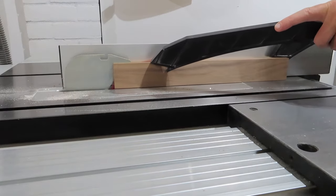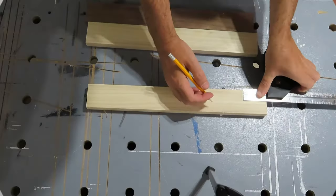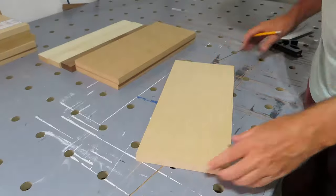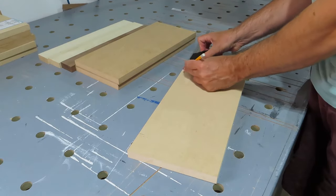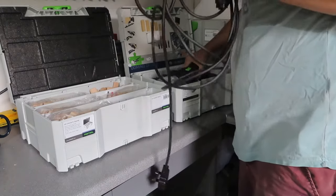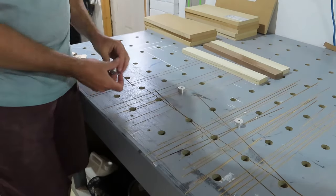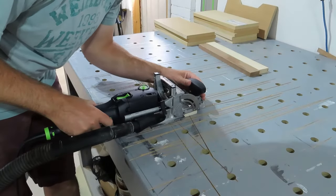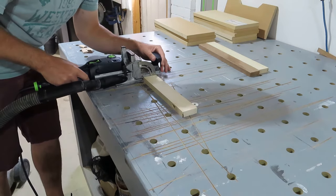Walnut — that's got to be worth a few subscribers. So to fix the hardwood tops to the MDF, I'm going to use dominoes, because YouTube told me that if I want to make videos, I've got to show Festool tools. I only want two on the outer edges, because I don't want them interfering later on with any hardcore router action. You can see here that I've pretty much thrown the top of my workbench to the wolves — I regularly cut into it now, but I'm planning to make a new one for a future video. My advice? Don't wait for excuses to come along, just make your own.